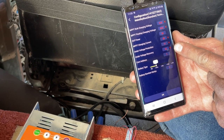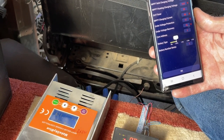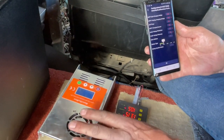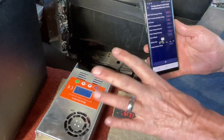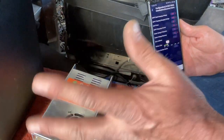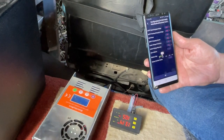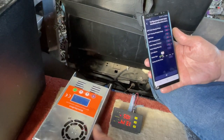It turns off at 11 volts — when the battery gets down to 11 volts it shuts off and turns back on at 13 volts. Did you get this off Amazon? Yeah — MakeSkyBlue. There's one that looks just like it that's actually a little prettier but it's a knockoff. Many people who installed those have had problems, and this is the better unit. It's not quite as pretty but it's got better reviews, and inside this one looks much nicer when you tear it apart.